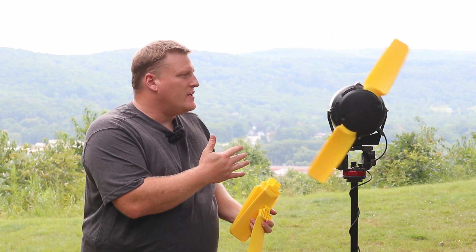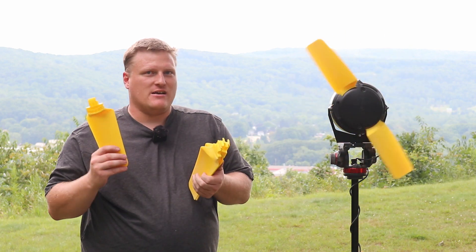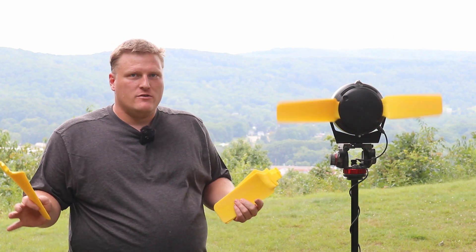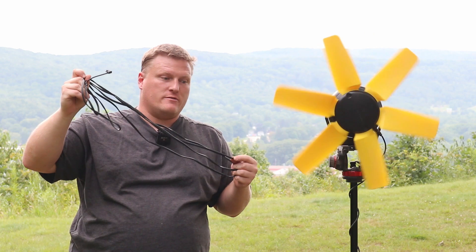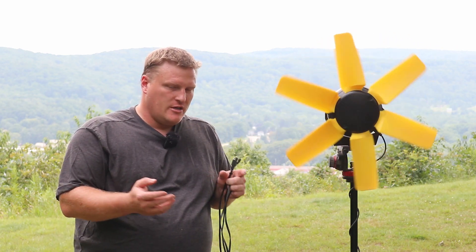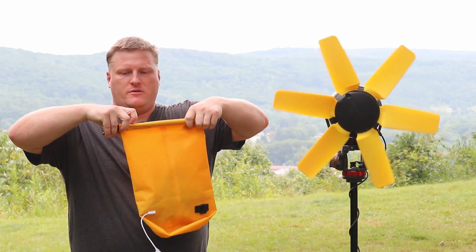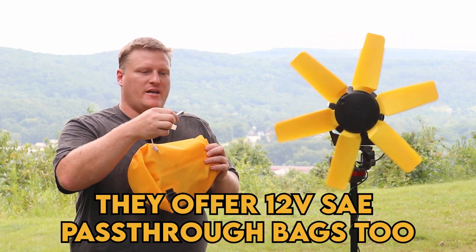The more wind speed you have, the faster you'll wear out the bearings and the greater the potential of knocking the whole turbine over. Reducing the number of blades under really high wind speed is better for the turbine and your power output. Another thing I learned: don't try to transmit 12 volts, or even 5 volts, over long distances — it doesn't work well. It's best to have the device you're charging right at the turbine, and when it's full you can disconnect and swap it out. They offer a handy waterproof bag — you just roll up the top and clip it together.